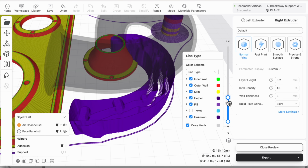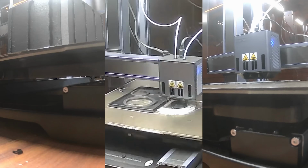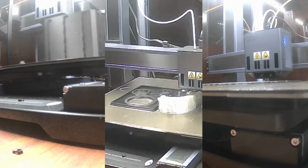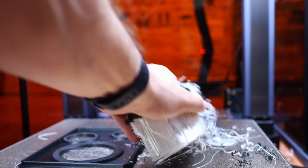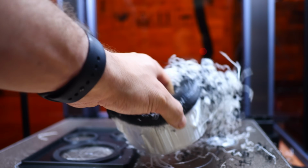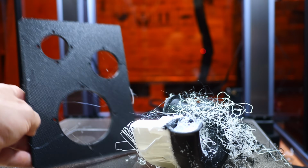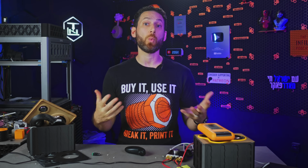the end result. At first, I tried some leftover Bambu Lab support for PLA material that I've had lying on this shelf for ages, just as a basis for comparison. I've honestly always hated this stuff for a few reasons, but I figured that if I could save the more exotic stuff, then I should. The end results were okay, but as expected of some old material, they were very stringy, and I don't think I cleaned the build plate nearly well enough because the purge tower did tip over. Still, I was able to remove all this.